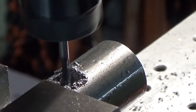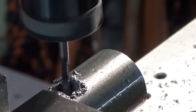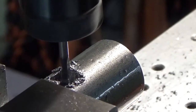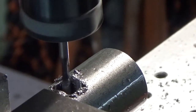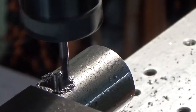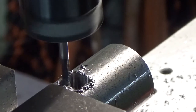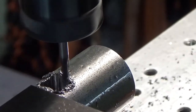I took a 3/16-inch end mill and in about six minutes I cut a square hole through there, 5/16 inches across. That didn't take long — it went really quick. I've left the center set at 0-0-0-0 the whole time. I drilled the hole, then ran the first routine to cut the basic square hole. Then I went back in CAM-BAM and changed the software to use a 1/8-inch end mill instead of a 3/16-inch end mill.